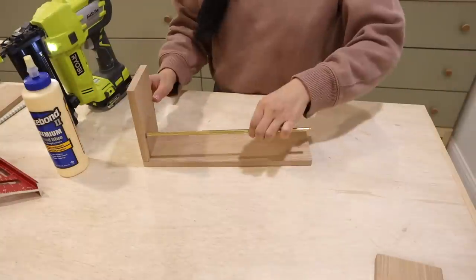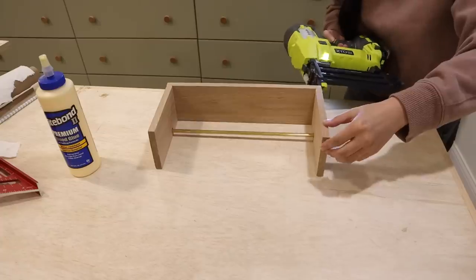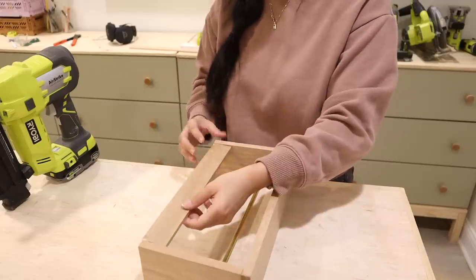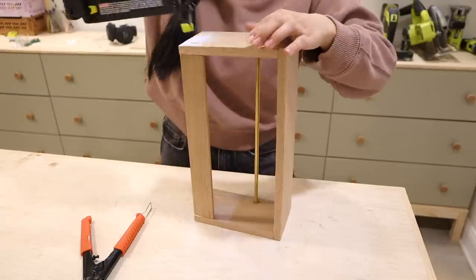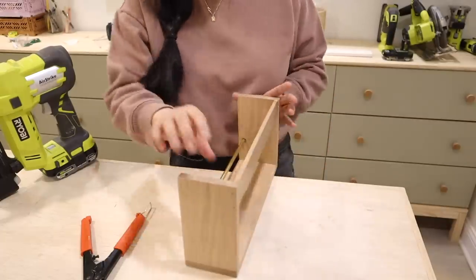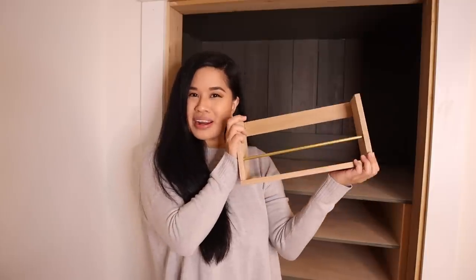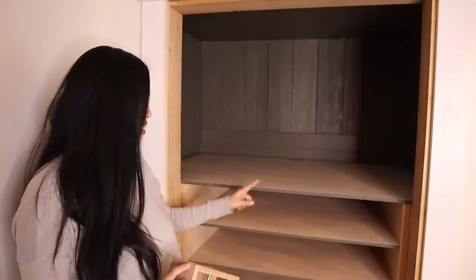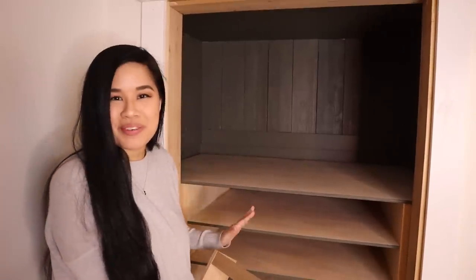You want to find a drill bit that is the same size as the rod and drill a quarter of the way into the wood. I will link down below where I got these brass rods, but you could also use just a regular wooden dowel, spray paint it gold, and that would work really well as well. I used a little bit of glue just to keep it in place and then I figured out the size for my bottom and back support piece. The wood I'm using is pretty thin so I just used wood glue and brad nailed it together, but if you want to make something a lot sturdier make sure you use select pine or something like that and use screws to really keep it in place. And voila — we have an Anthropologie-inspired shelf done for just a fraction of the price. This came out super cute and also very much like the original, so I'm pretty happy with it. It is now time to start installing and styling everything and also organizing all of my paper in here. I'm so excited because now we have a little office command center and it's just going to be so much more functional than what we had before.